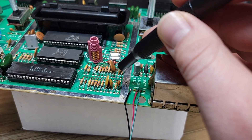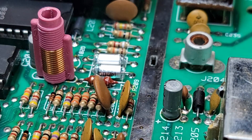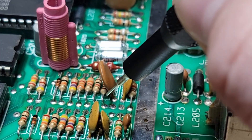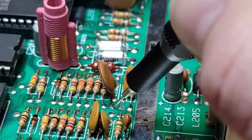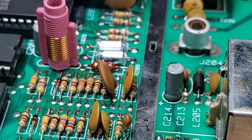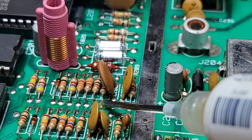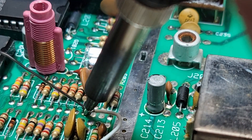Next, we will solder the white wire, which will provide the audio-in signal. This is one of the most challenging parts as there are many board variations and different layouts. You will need to find this row of resistors, counting from right to left, and we are going to solder to the fourth pad. It's important to note that the third and fourth pad do connect, which makes this task far easier. As with any soldering in this video, it's always important to start with flux. I'm using a set of helping hands to hold the wire in place while I apply heat and then solder.